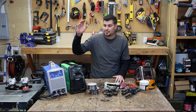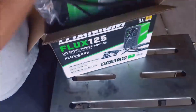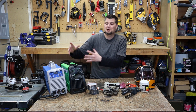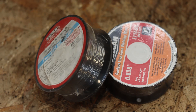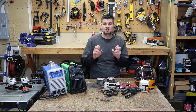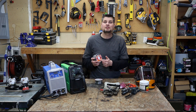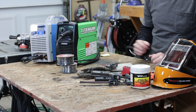Let's get into some of the extra things that can help you along the way, aside from the welders. I have other videos on picking welders, but I do have these two — some of the cheapest welders out there and they both work great. There are probably a thousand different types of wire; just make sure it's inner shield or flux core wire. I'd say stick with 0.030 wire — that will get you started and through a majority of your projects.